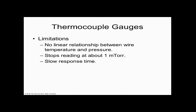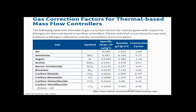In fact, I'm working on a machine for a colleague of mine, and we have that problem. The ion gauge doesn't turn on or it's burned out. I told him it should come on because it should be below 10 to the minus 3, since there are two thermocouple gauges on there and they're at zero. And the ion gauge is telling us that we're above that. And I'm like, well, two gauges are telling us the other gauge is broken. That's the ion gauge. So does everybody see that?